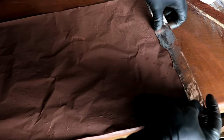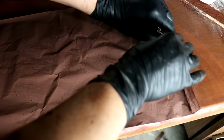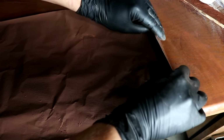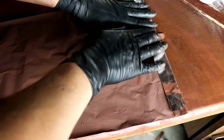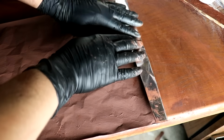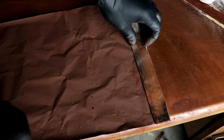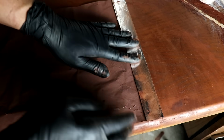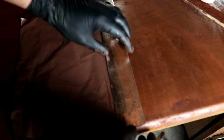So the difference between powder and this foil is kind of like the difference between trying to light dry grass on fire or lighting a piece of plywood on fire. Both are perfectly possible to light, but the dry grass only requires a spark or a lit cigarette thrown into it, whereas a piece of plywood requires sustained heating for long periods of time. You can't just use a match on it. So what I'm doing here is essentially chopping up the plywood into smaller pieces so it more resembles the dry grass. Anyway, I'm just folding this over so that the iron oxide is completely encapsulated by the aluminum.